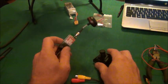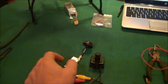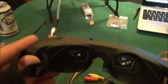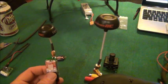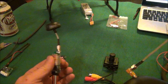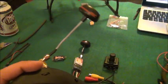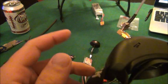On the other side of that I have the FatShark Attitude SD goggles. These are my receiving source for the video — this has a built-in 5.8 GHz receiver. This is very important: you have to be on the same frequency for these to work. If you want to use 1.2 GHz or 900 MHz then you'll need a separate receiver. In this case I always fly with the goggles so I'm just going to use the built-in receiver which is already on 5.8.